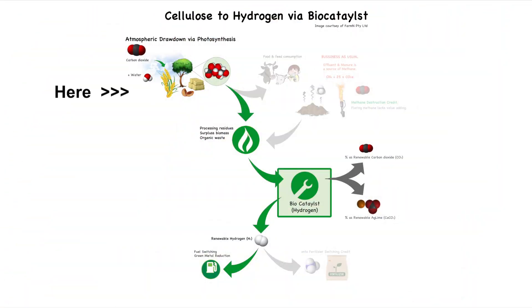Let's step through the two processes of green hydrogen and renewable nitrogen fertiliser. Both technologies require a sustainable feedstock — that feedstock might be straw-based, or wood-based, or could even be a by-product like a nutshell, a grape marc, or even an effluent. That biomass is then treated with steam, followed by a specialty enzyme that digests stubbles and breaks down the polymers. The biocatalyst has been specifically designed to convert those sugars and produce hydrogen, which may be directly used as fuel, run through a fuel cell to produce electricity, or used as a feedstock in ammonia manufacturing.